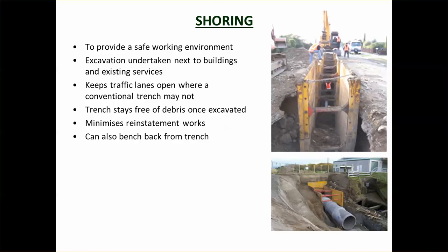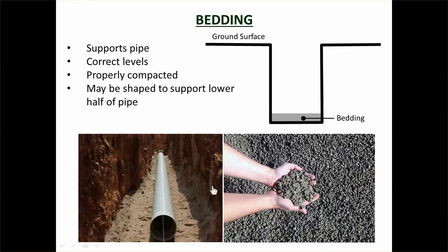When people are working in a trench below 1.5 meters, you need to ensure they're safe. If the trench collapses, workers can be suffocated or crushed. A trenching shield prevents this. You can see workers trenching in very unstable ground — the shield provides protection for those in the hole. It consists of two steel plates with a brace between them, set up on the ground surface and then lowered into the trench as one unit.